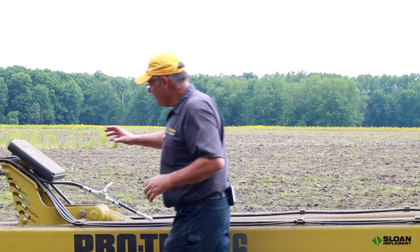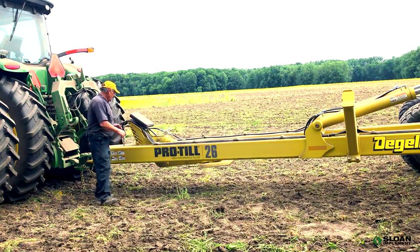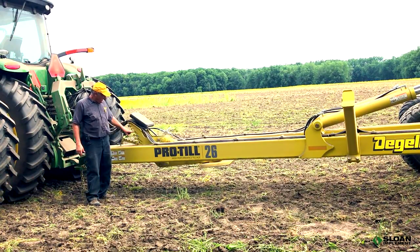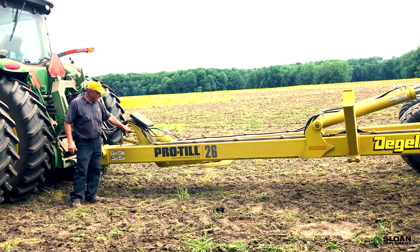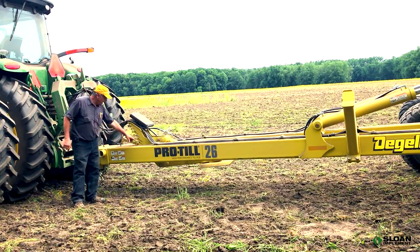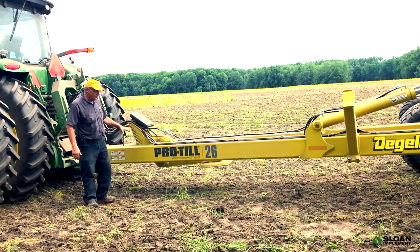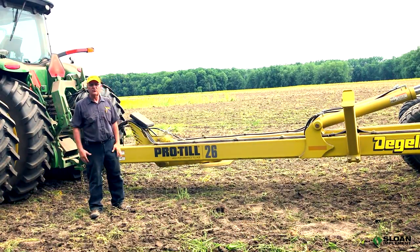We have our operator's manuals right up here in the front. We have a very nice arrangement for hydraulic hoses — you pull this out, set the hoses in here, and hang the tips towards the inside. Each outlet is color-coded: number one is number one valve, which is for our depth. Number two is for our wings folding. Number three is for our transport, folding it back and forth. Number four is for the jack. This keeps them from dragging on the ground or laying in the dirt when you unhook and want to use the tractor for something else.